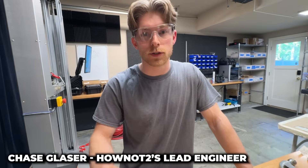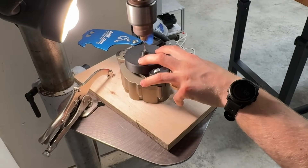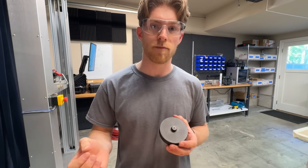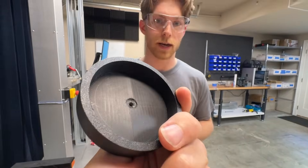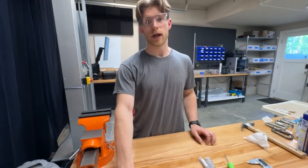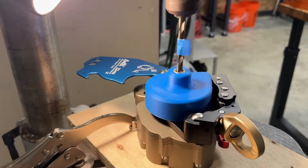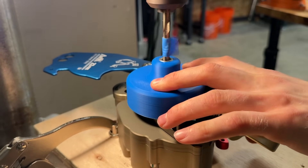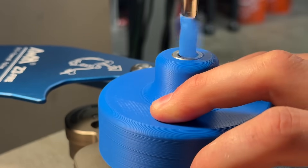Would you like to see how they go on? First step is drilling your pilot hole. When we're looking at that rivet in the middle of the wheel we need to make sure we're drilling directly through the center of it, so to start we use a 2.5 millimeter drill bit. I designed this jig to hold that drill bit in the exact center of that rivet, and that pilot hole is going to guide all of our drill bits going forward. Step one is the 2.5 millimeter pilot; step two is actually getting rid of that rivet — it's an 8 millimeter rivet. This fixture has an 8 millimeter hardened steel bushing in there which is perpendicular to the plane of the wheel and coaxial with the shaft.